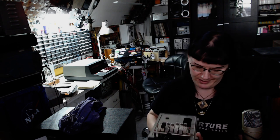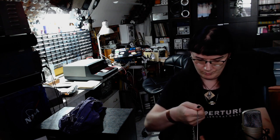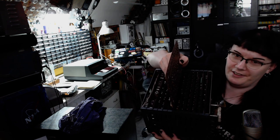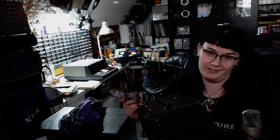As for other equipment for servicing those Soemtron calculators, there were riser boards that would basically transfer the 62 contacts on both connectors. Let me grab the extractor. You just put the riser board in the slot, and then put the board you are troubleshooting in the connector of the riser board. So you had free access to all the traces and connections and parts.